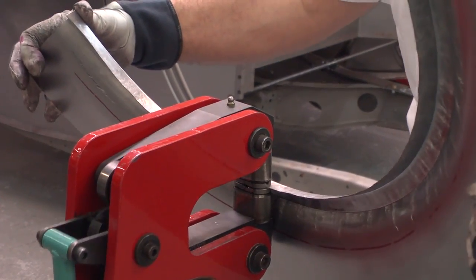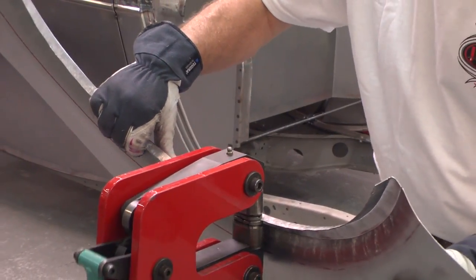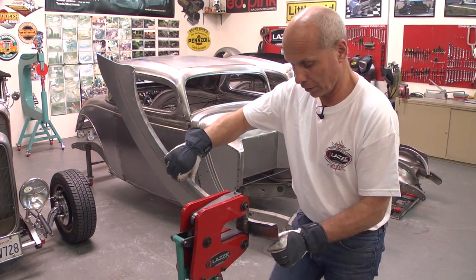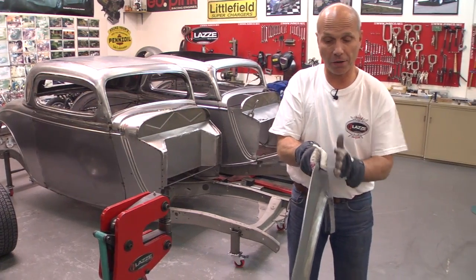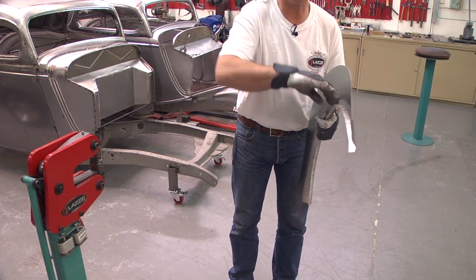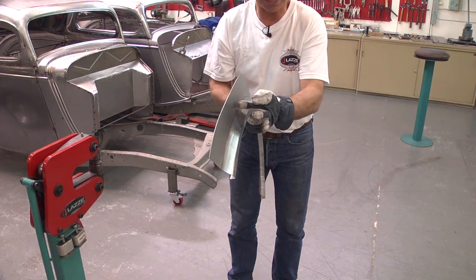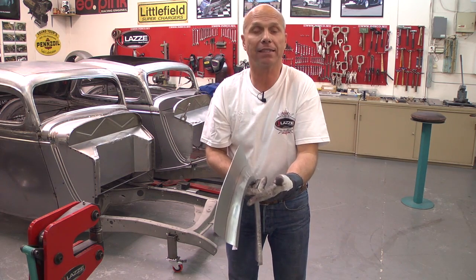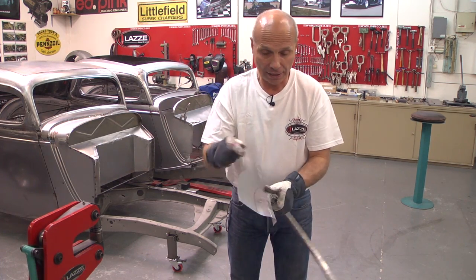I saw I needed a little more so I went back again. As I said, it depends on what shape you're looking for. You can see the whole thing is more straight now. You can move this edge to the shape you want and it will follow. Of course, if you want a different overall curve shape, you should establish that on the first part when you roll and stretch — get that shape first, then go to the next steps. Changing the whole curve now with this flange is very hard, it doesn't move.